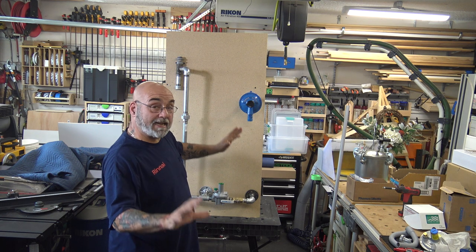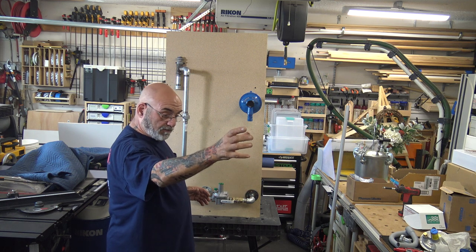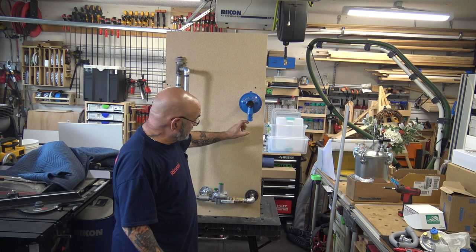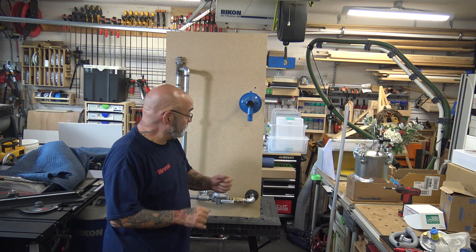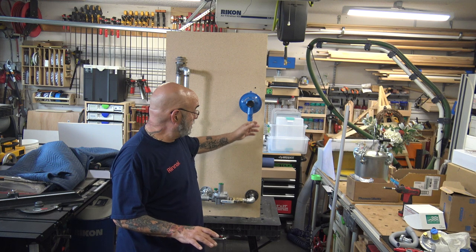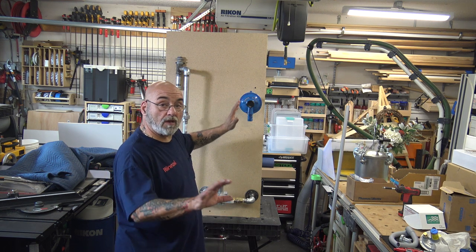These things we love because, again, like I said, we have a propane tank, say 30 feet away. We dig 30 feet. We come up. We bring a riser up over there. We bring a riser here. We already have our hole drilled going into the house. We make up a valve, then a galvanized nipple. Remember, your riser actually could be used as a union to take it apart. Also, this here is a union half. Just be careful. If you're backing something off on this, it will unscrew. I never touch these things, I just leave them alone. And then we just make everything up, push it into the house. We use the back plate. If not, there'll be a T here. And we go to the tankless, everything's nice and strapped to the wall, and we're done.